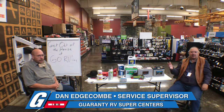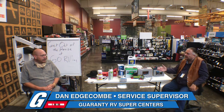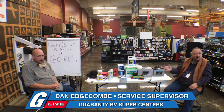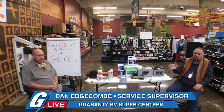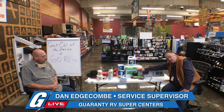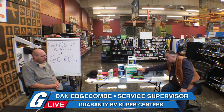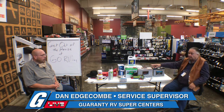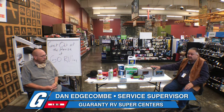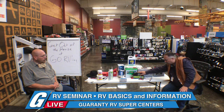What our industry considers a dead battery — what's the voltage? Eleven and a half volts. If you look at a Group 24 flooded cell deep cycle battery rated at 80 amp hours, that's at 12.6 volts. If you take it down to 11.5 volts, you've basically consumed that 80 amp hours.